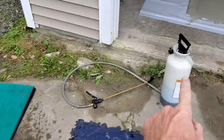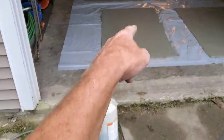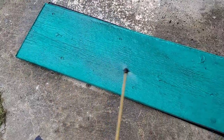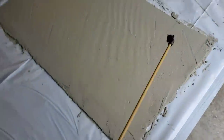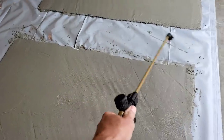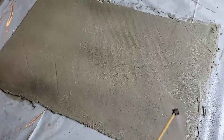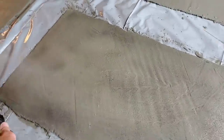So here's the stamps. First thing we want to do is use the liquid release and spray the stamp. Then we're going to spray the surface of the overlay to make sure everything's got good coverage on it. You only want to spray it a couple minutes before you get ready to do it, because this stuff evaporates pretty quick. I can see some of the charcoal color in there already — it looks pretty good. We'll get a good coating on that, make sure nothing sticks to it. That's ready to stamp right now.